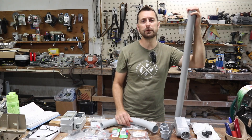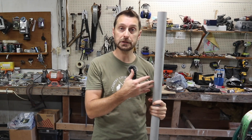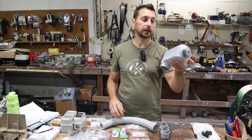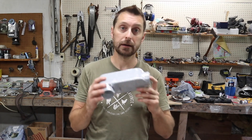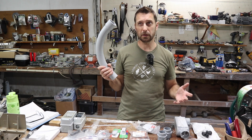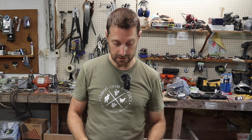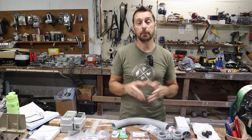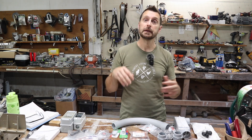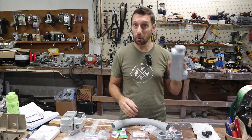Now some people say you can direct bury PV wires — that is true, but don't do it. It's always best to have it in conduit. Each one of these 10-foot sections of inch-and-a-half PVC electrical conduit is $23. These 90-degree elbows are close to $5. This is what's called an LB box and these are almost $10 a piece — for the barn system I have five of these, that's almost $50. On the barn system I have four 90-degree bends and one 45-degree bend, and that one was close to $8. These threaded male adapters are $4 each, and then for those you need lock nuts at $0.75 each. I also recommend getting an insulating bushing as the wire comes over the sharp edge — these are almost $1 a piece. My total run for AC wires into the barn with risers and all electrical connection boxes was roughly about 70 feet — and we are adding up really fast, and I'm only talking about conduit.